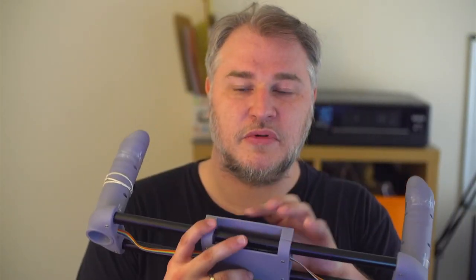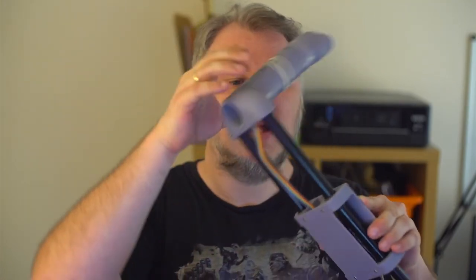Further development on the controller needs to be done. We need to bolster this. Some of the 3D prints, they're not completely tight and stable. This works really well. This flops around a little bit. Drilling holes and having stable screw holes is one of the weak points of the resin printers. So we need to investigate that. We need to redesign some of those.